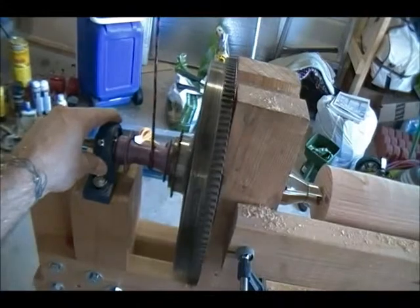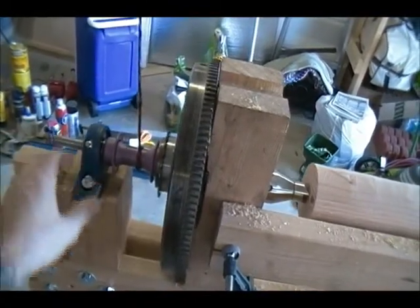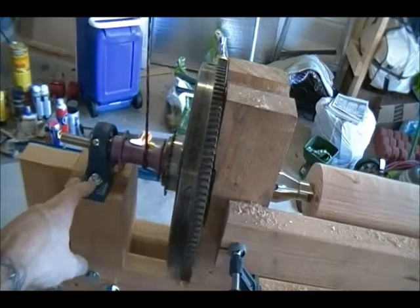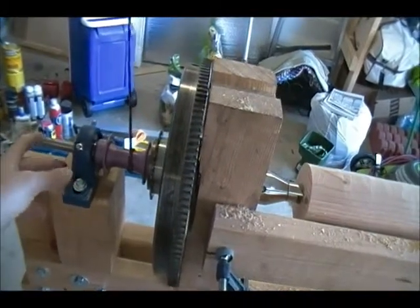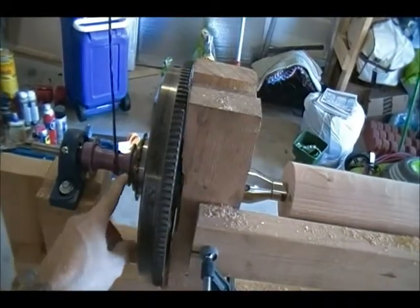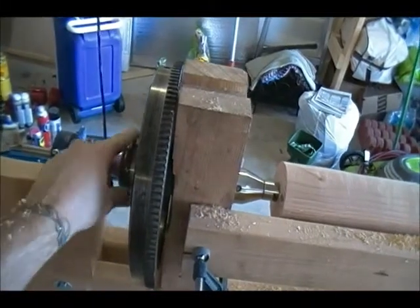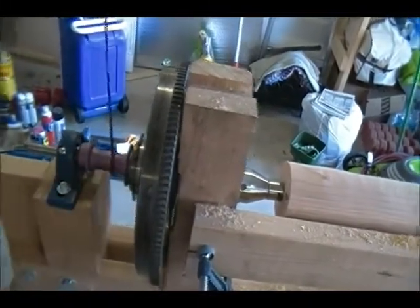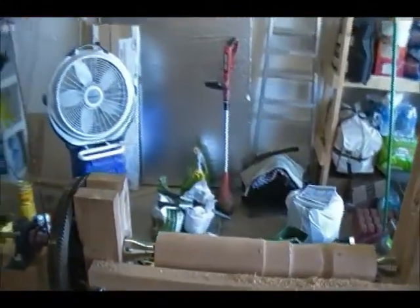And then we just added a pillow block bearing back here, just to allow us to maneuver the shaft to make sure that it's in line. So this shaft runs through the center of this. We bored the center of the hub, and that shaft runs through to about right here. And then this is actually attached to the hub itself. So I'll show you real quick how this works.